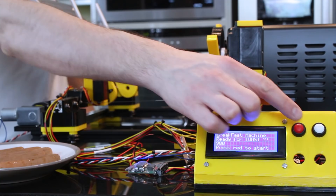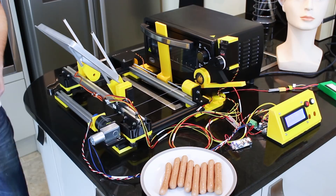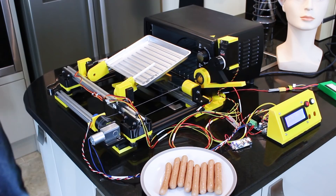The machine's ready to go. On the display it says 'press red to start,' so let's press that. It should set the timer and turn the oven on — I've got a 30-second preheat. You'll notice a little thing counting down on here showing the amount of seconds, and eventually it should get to 30 and then we'll be ready to cook the food. I'd probably preheat the oven for longer in reality, but for the purposes of the demo we've just got 30 seconds. There's a phantom digit on the end — I should have cleared the display before I started. That timer variable counts no matter what it's doing, which is why there's an extra digit.